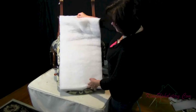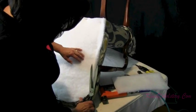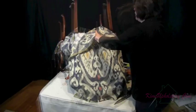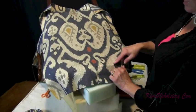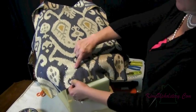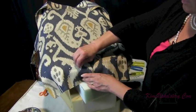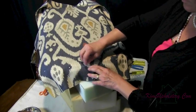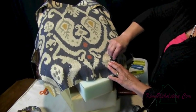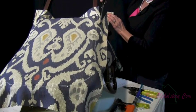Now we're ready for the fabric. I've got my piece of Dacron cut out for the chair — it's a little bit big but we'll get it started. Anywhere I'm hanging over on the sides I'll trim it down. I've cut my fabric out and I want to watch the center points. I'm going to get a temporary staple at an angle right here, then use some pins to secure the back in place while I chalk it. I'm going to feel the row of cording and that's where I'm going to draw my chalk line, all the way around. Then I'm going to start cutting just to the outside of my chalk mark — about a half an inch.